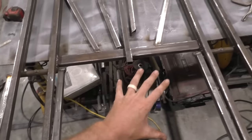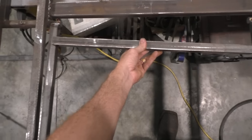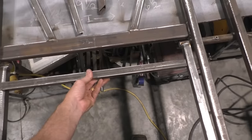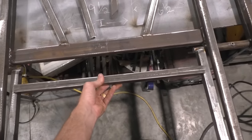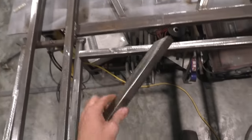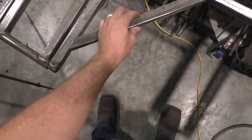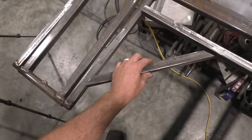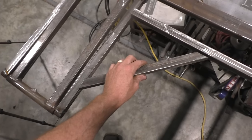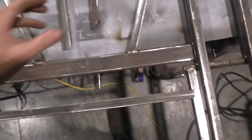Now we're gonna give us a little structural support back here. You gotta make this thing loud and proud, super strong, right? Just cut your cross brace roughly an inch or two from the bottom of your arms. Run that across. Cut yourself two gussets, somewhat close to the center of your crossbar, and somewhat close to the top of your risers there, and weld that in place. And that's gonna give us our strength and need on the back. Then we'll proceed forward with that.